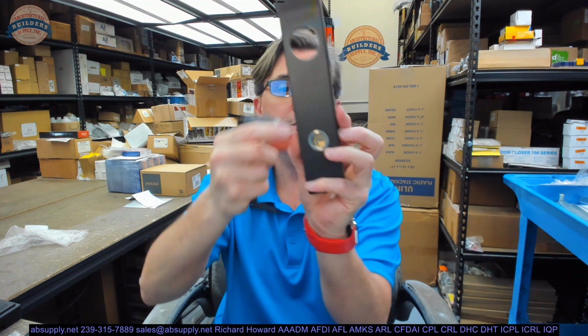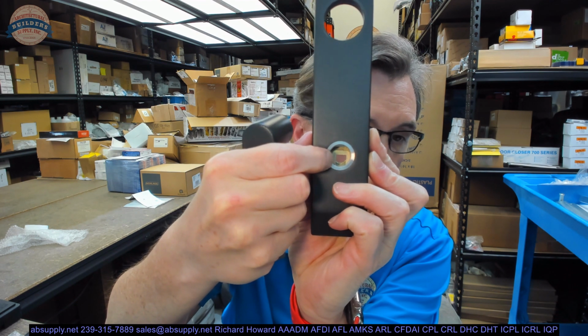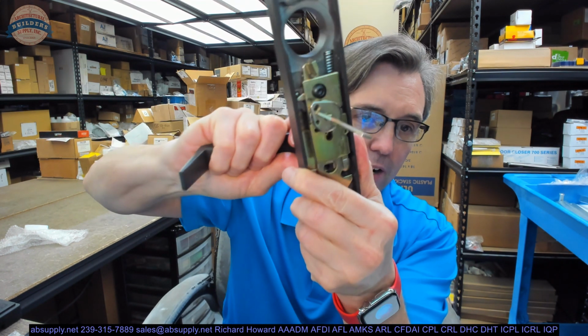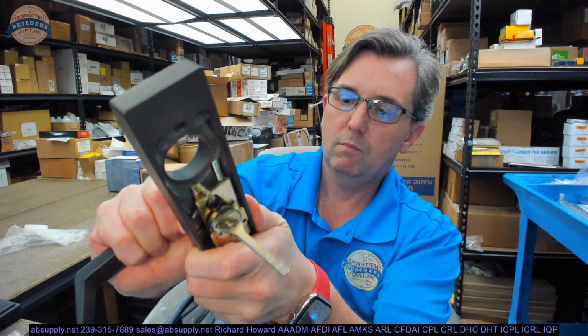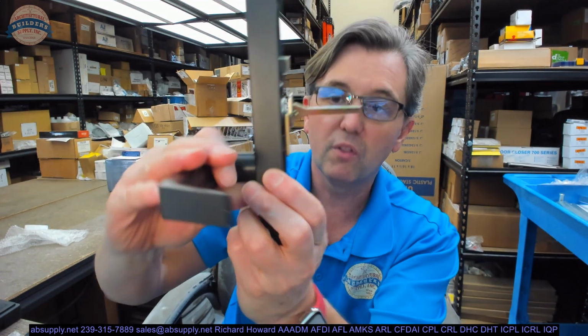So you're going to buy this because you need lever trim on the outside. Okay, the lever will come loose. It's a little bit of a chore to get that installed there. You can see that that spindle, well, the hub where the spindle goes into, is not exactly straight. So I kind of had to get it in there a little bit on an angle to lift that hub up. And it does go in. You just have to kind of get the hub lifted up, and then it will go in.